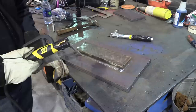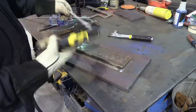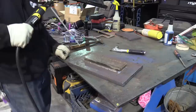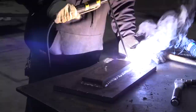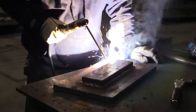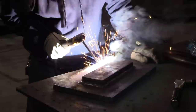Let's talk about different hand positioning. I use this method a lot — like a pinky-to-thumb type collapse — I can relax this way and change angles a lot. I do it a lot of different ways; sometimes I just hold it with one hand. Coming around a corner like this, you've got to plan ahead a little bit and change rod direction — twist your wrists sometimes. Making a dry run or two kind of helps settle in your mind what you're going to do when you get there. I'm trying to give as much advice to beginners as I can, folks in welding school who are going to weld around a corner on their first job. You might not even do anything like this in welding school — you do a whole lot of straight runs, practice plates, test plates. Oftentimes you don't get to weld odd angles, so it's good to get a little of that under your belt.